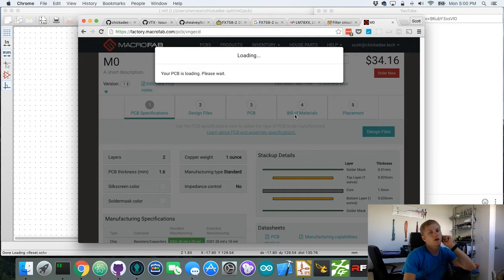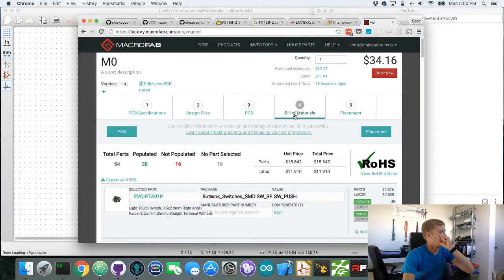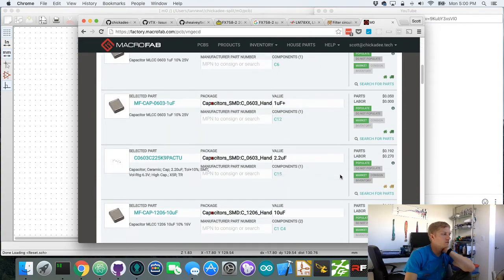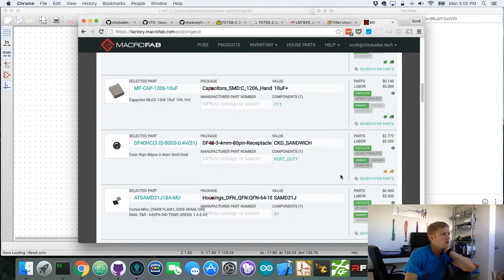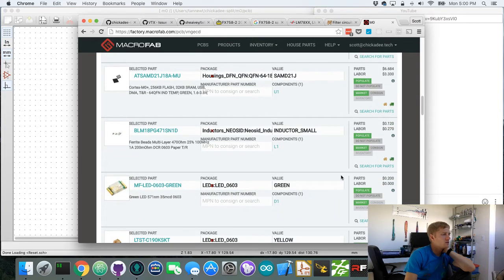So what we need to figure out with this inductor is whether it can handle the current that we'll potentially be pulling through it. It was like up to an amp, basically. Although it only said 400 milliamps, but I don't really believe it. But this is the part. 1 amp, 200 milliohm.